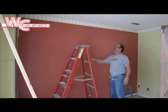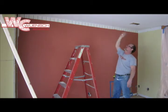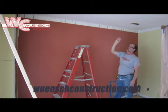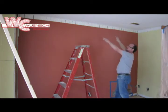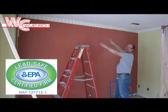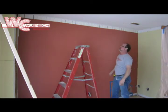We're going to remove this bearing wall here. I cut a line up here to open the sheetrock so I can take a look up there. I know the joists are going parallel with the wall, so the floor load is not on it, but there is a roof load on it. We're going to try to slide in the LVL beam from this side over to the other side while the wall's in place, then nail it together and take out the wall — and that'll self-support. So let's tear some sheetrock down.